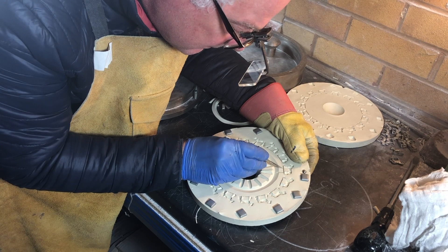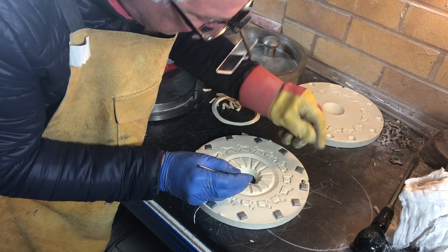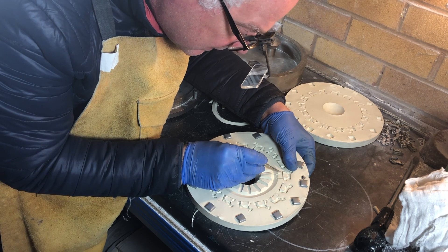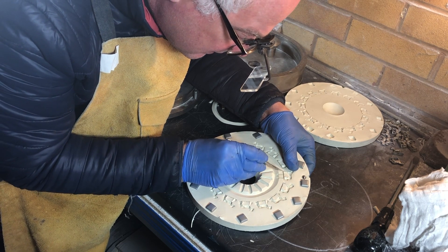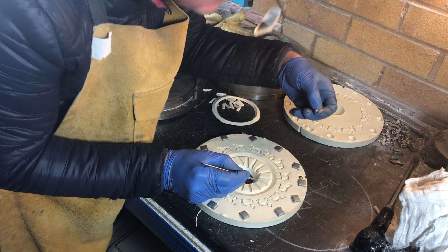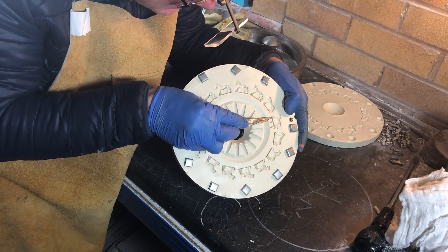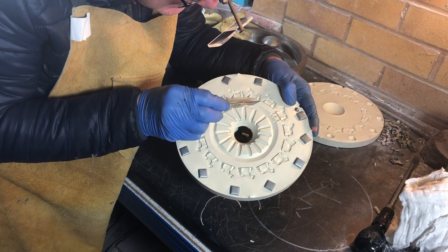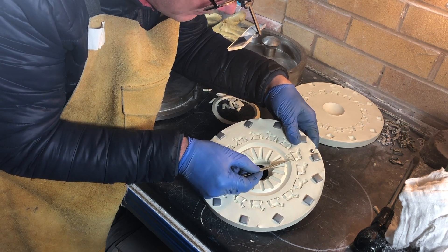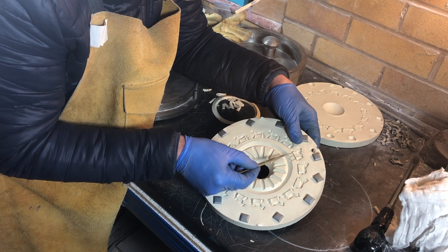Cut, flip — and again. That's three kiss gates, and you can see there's a nice gate really neatly done. The first is designed to feed up the front legs, the second up the back legs, and this one makes sure the middle of the base fills with metal as well, because with just two you can get metal not quite meeting in the middle.